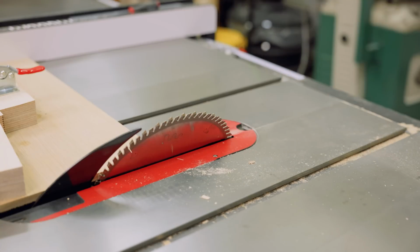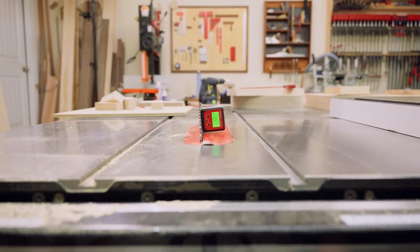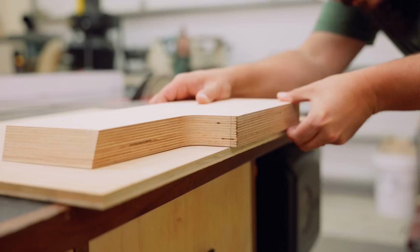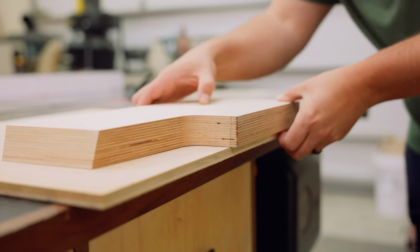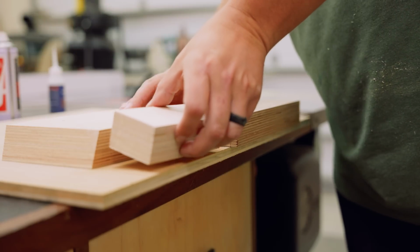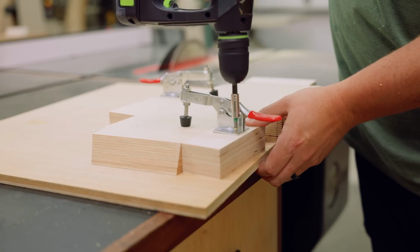With the lower bevels cut, it was on to the center miters. Believe me when I tell you that I overthought about these miters for 2 days ahead of these cuts. And that's really because if these miters are too narrow, the backrest isn't going to align with the sides of the seat. And if they're too wide, I'll have to chase down the correct length and things become more stressful. So it was really important for me to nail my cuts for each part.